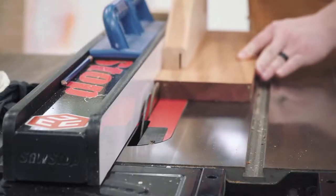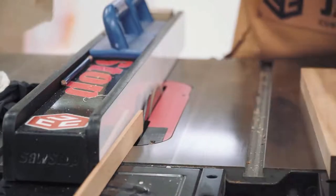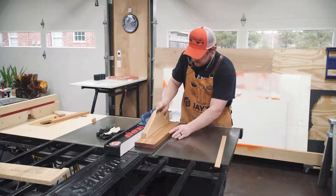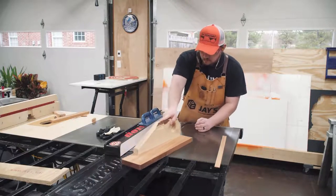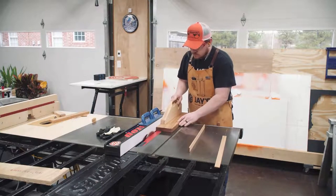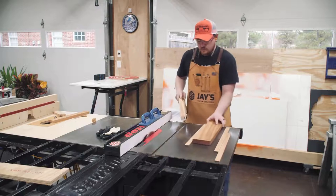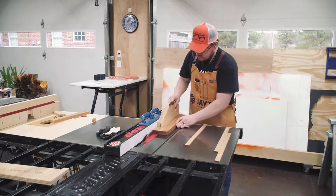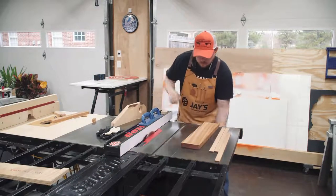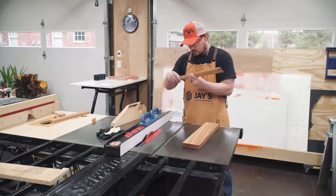The last pieces needed before assembly are the one-eighth-inch strips glued to the bottom of all the rails. This is one of the many reasons I think a 2x6 push stick is the best all-around option at the table saw. The sacrificial flat bottom provides stability and holds down the material on both sides of the blade while allowing the blade to cut right through it. The sacrificial hardwood cleat on the back edge provides a mechanical connection to prevent the push stick from slipping over the workpiece, and you can safely and easily cut strips one-sixteenth of an inch or less between the blade and the fence. Pick yours up for free at your nearest scrap bin.